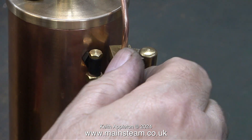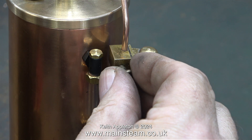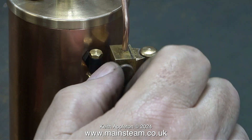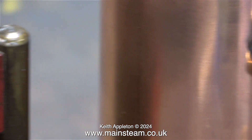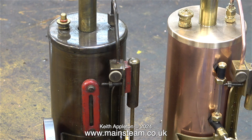The speed of a Burnak Vulcan is regulated by a 4BA bolt that partially blocks up the exhaust — I wasn't sure what to do about this. I was looking in a box of hand wheels and bits and pieces to make up a special fitting, and whilst doing this, believe it or not, I found a genuine Burnak Vulcan valve. I have no idea where it came from — it was just sat in the box. I'm screwing it into the block at the top of the engine. Here it is and it's looking good. Just to show that I haven't taken this regulator valve from the other Burnak Vulcan, I'm panning across to it — and as you can see, there's one in that also. I'm quite enjoying creating this Super Vulcan.